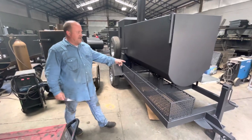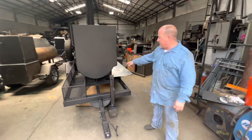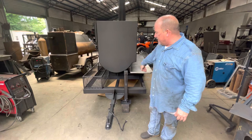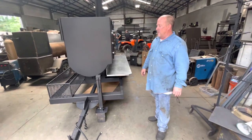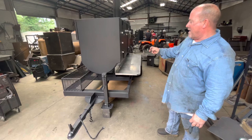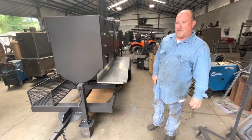Again, it has a grease drain right here. One thing, Jason — I didn't have time to do it, and I'm going to leave that up to you. It's very simple. The way this grease drain is set up, I ran the tubing all the way back. You need to get a close nipple — a 2-inch close nipple — a 45-degree fitting, and another nipple, and just 45 it out so the grease offsets. That would be a good idea. I didn't have the 45s and nipples here. You can also hang a bucket or pan right there, but it would be best to get a 2-inch close nipple, a 2-inch 45, and another nipple — that'll get you off where you need to be.